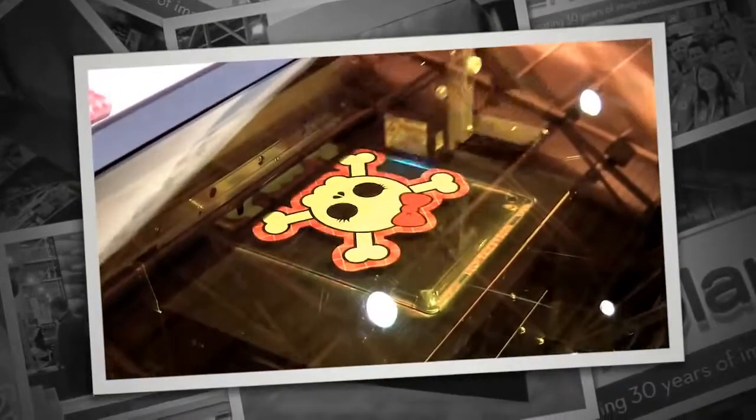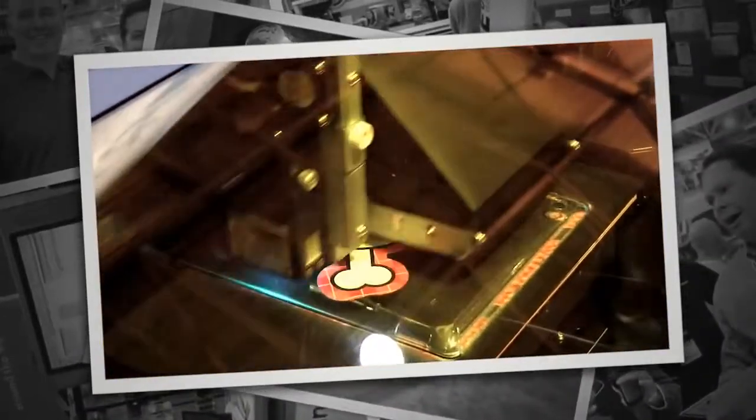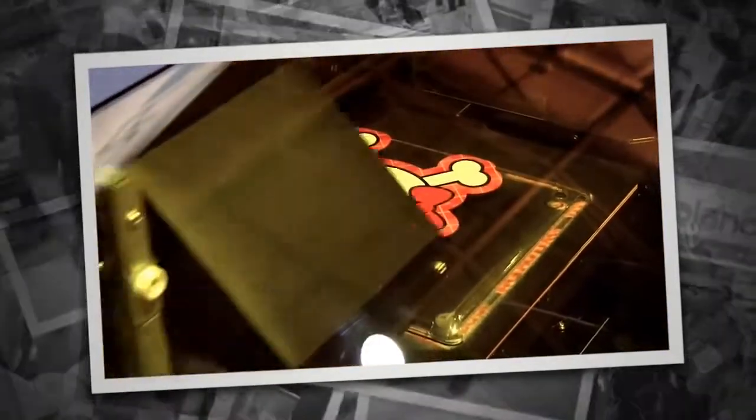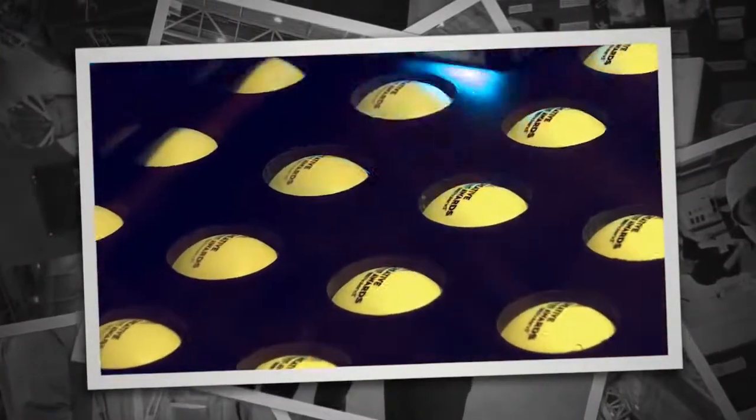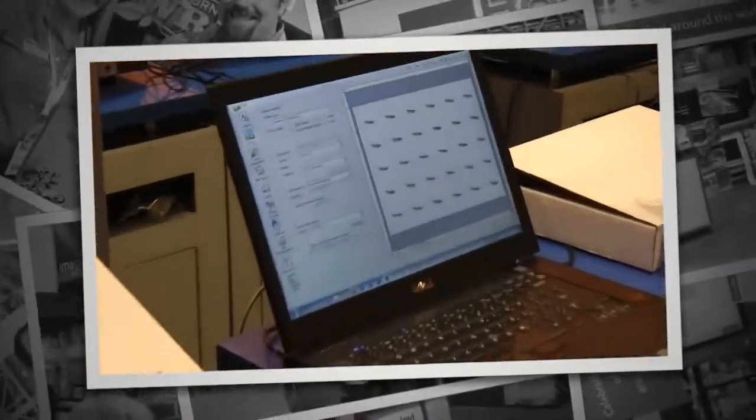It has a printable area of 12 by 11 inches and can handle materials up to 4 inches thick. It uses a CMYK, white, and gloss ink set. With the gloss, you can do matte finishes, gloss finishes, embossing, as well as textures. The LEF12 is run through our Roland VersaWorks RIP, which is our tried-and-true RIP for the product. It has all the profiles, color swatches for Illustrator and Corel, as well as a complete texture library.